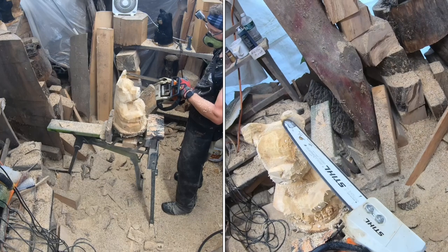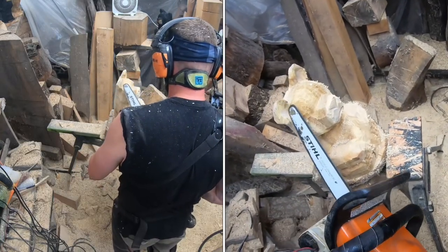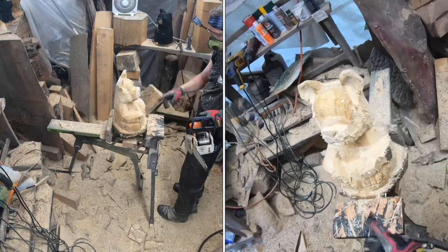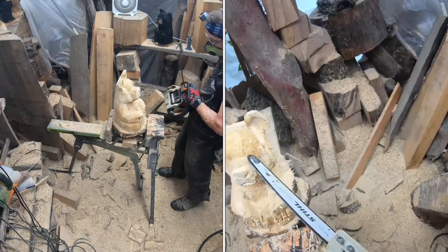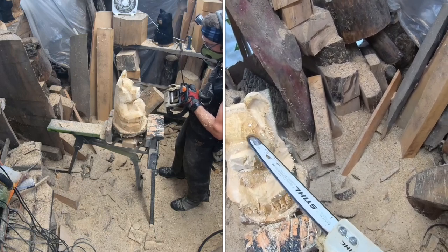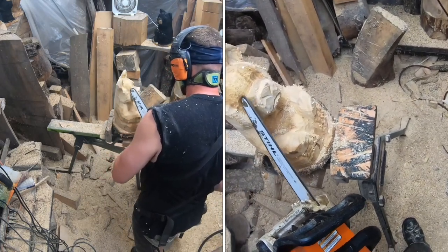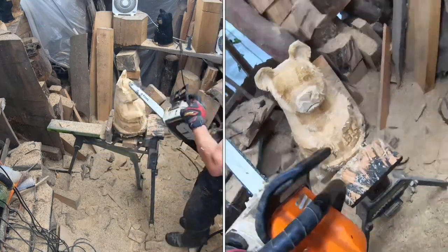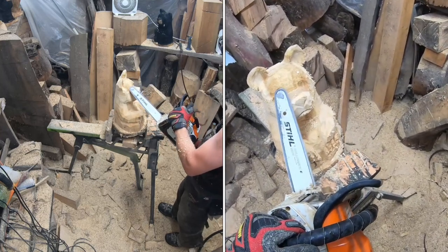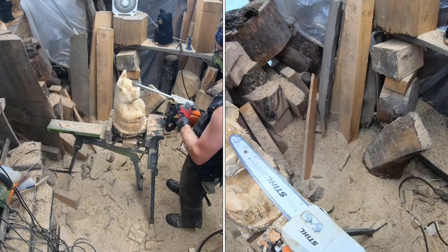For the ear, we're using just the underside of the nose, kind of scraping inside the ear to make it concaved. With a sharp saw and a good grip you can do a lot of different shaping — but you've got to have full control, or you're going to make a big cut into the ear or cut it off. That same process we're doing close to the snout on the front of the face — making a concave indent where the eyes are going to be, using the underside of the nose where it just starts to round. Then coming in with the edge of the nose at an angle to define an eyebrow area so he has a little more character.